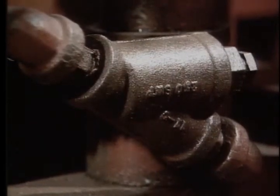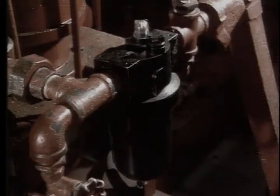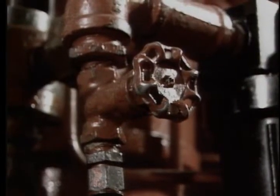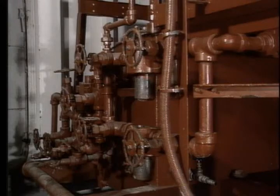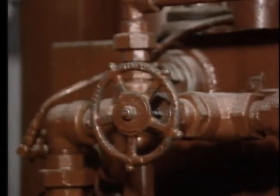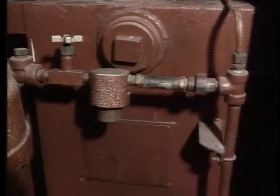In the hydraulic line there's a strainer upstream of the backup pump and a check valve at the pump outlet. Rig air operates the pump — here at the air inlet, upstream there's an air filter or air lubricator and pressure gauge. The hydro-air pressure switch operates the pump automatically, but a bypass valve allows you to operate the pump manually. Then there are the high-pressure filters: the 10 and 40 micron filter assemblies. Two 40 micron filters are on the discharge side of the triplex pump; each has a shutoff valve upstream and downstream to isolate for cleaning or replacing. The 10 micron filter is in the supply line to the pilot accumulators.